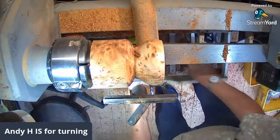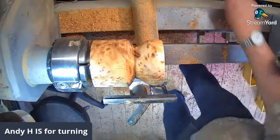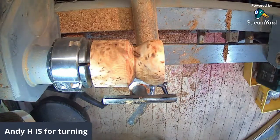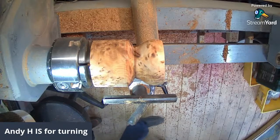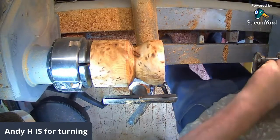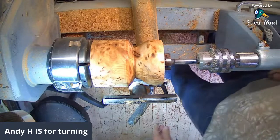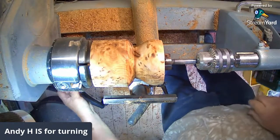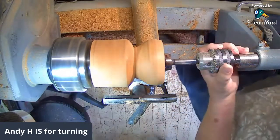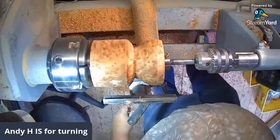What size do I want? I don't want to be any bigger than that - that's about 40mm which will do it. I'm going to go in with a 35mm bit - that'll give me plenty of room to do things in the middle without coming through the side. Turn the speed down, turn the drill on, lock it in place and turn the handle. Don't you just like it when you talk to yourself so you know what you're doing? 50mm will do it nicely - to you oldies, two inches. I was a woodwork teacher - I have to work metric.